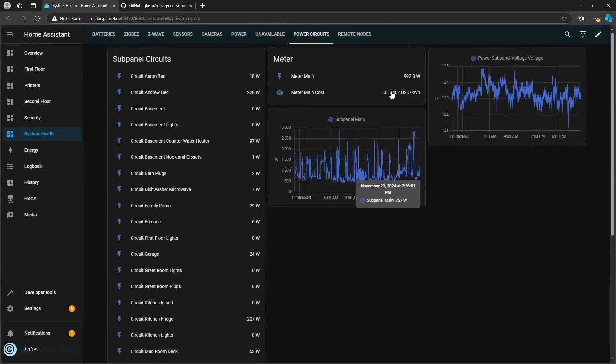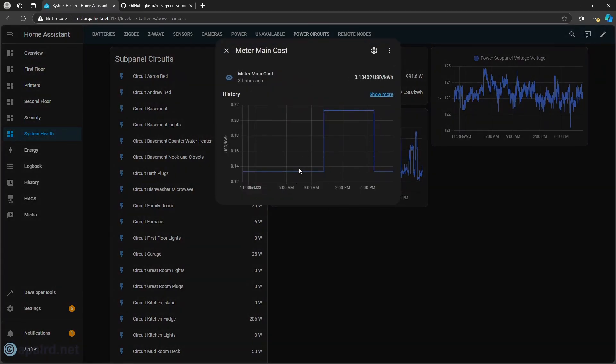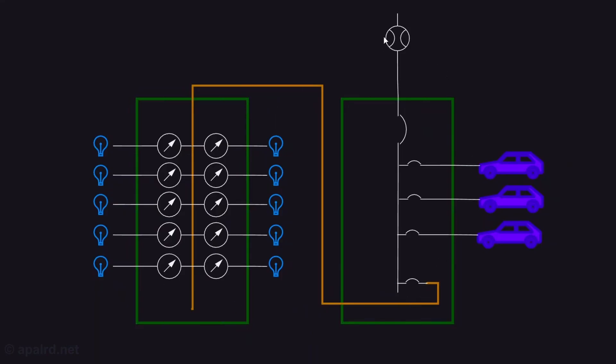I also added a track that keeps track of my peak rates — you can see how much I pay during night and how much during the day. Here's kind of a schematic diagram of what's going on. Power comes in from my utility company, hits my main disconnect in this panel where I have a bus bar, where I connect big things like the cars. At the bottom of this panel I have a breaker which sub-feeds over into the other panel. These breakers all have meters that I added today — they're actually just regular circuit breakers, I just drew them with a meter symbol because they have meters also. That goes out to all of my loads in the house.